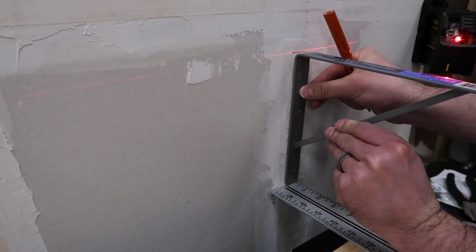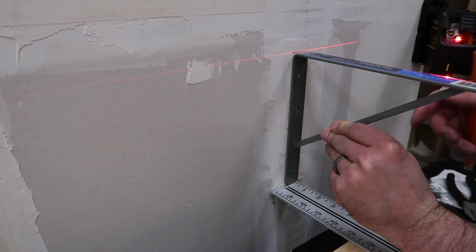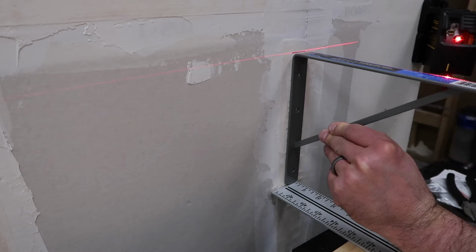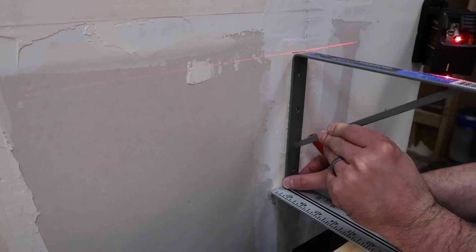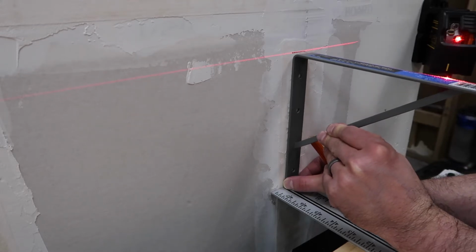I want the right edge of this on the right edge of my straight edge, because I want to hit the stud perfectly and have the shelf end when the workbench does. And I did change my mind. I moved the table over about 2 inches to the right so I can hit a stud perfectly on each side.